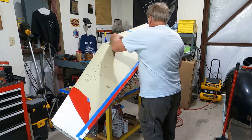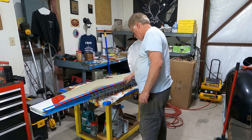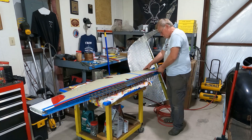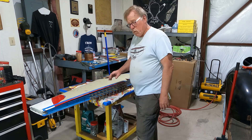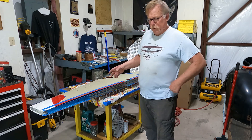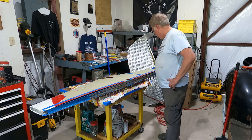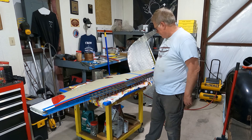Over it goes. We're clamped up at the tip and clamped in here. What we're doing is being mindful of our edge distance and making sure that our skin edge is all nice and straight. We're clamping these and then we work from the inside out drilling. What I'll do is dimple all this when I'm all done, just like you would on a new build. When we do the service bulletin work, we're going to be making a nest doubler in here, so for that reason we'll leave this all undimpled at this point.